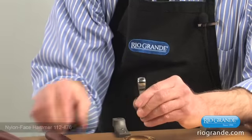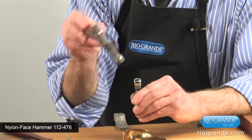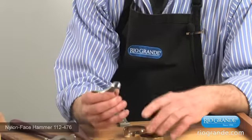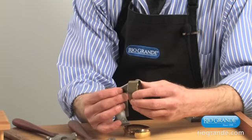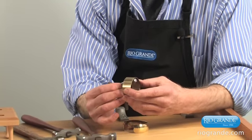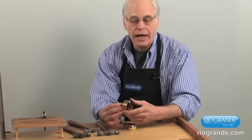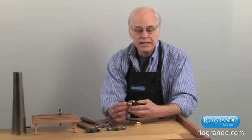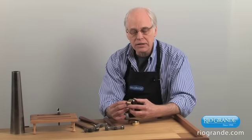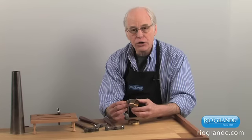We will use a nylon ended hammer to drive the metal down in the first course, and that way we won't stretch the metal, and it's very forgiving and it's relatively easy to do. The trick is to keep the metal in the same position on the stake as you're rotating it, so the same amount of overhang is exposed. And as you rotate it, the metal will dome.